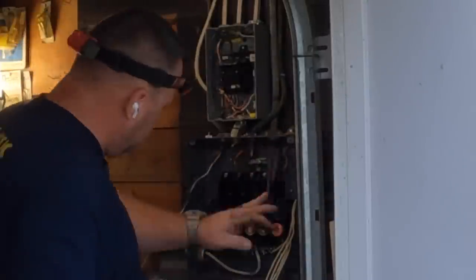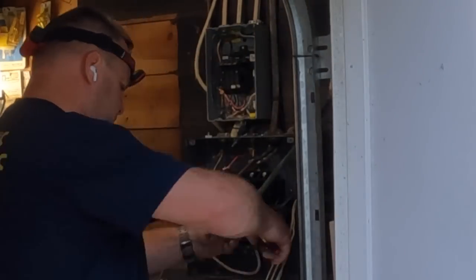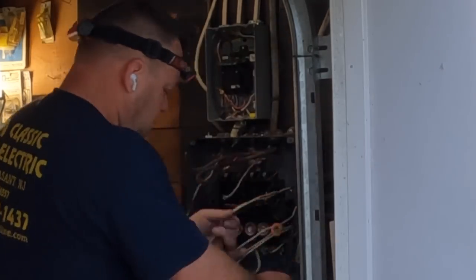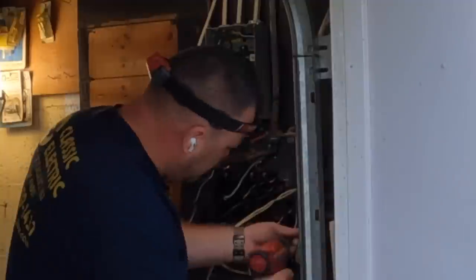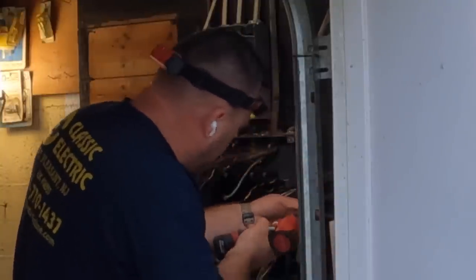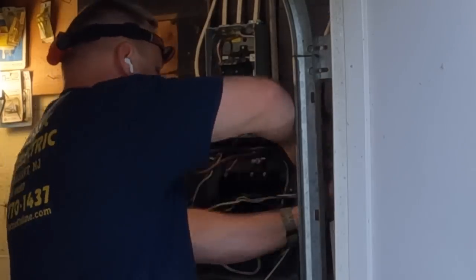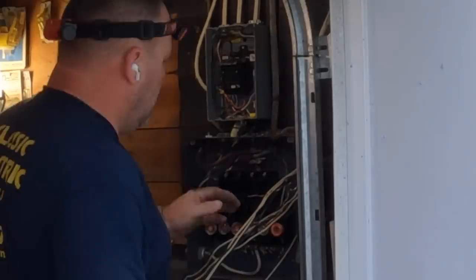There were a few errors in the wiring — a few double-tap circuit breakers. That main lug only panel up at the top with the four General Electric circuit breakers actually had six circuit breakers, and it was fed by a 20-amp 240-volt circuit down in the fuse panel. Somehow that lasted — obviously there's not much load on either of those branch circuits. Otherwise those fuses that supplied that main lug only panel would have overloaded over time. There were a lot of spare fuses there, so maybe they did blow a lot of fuses over the lifetime of this panel.